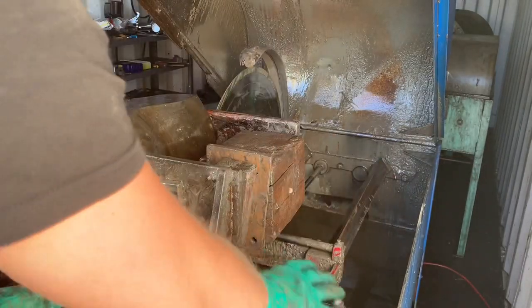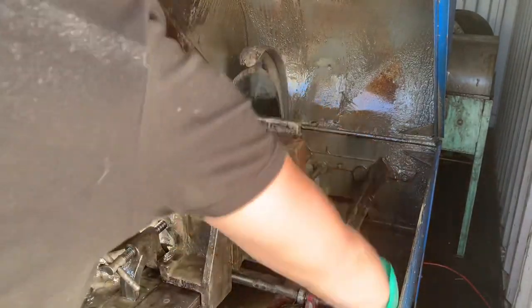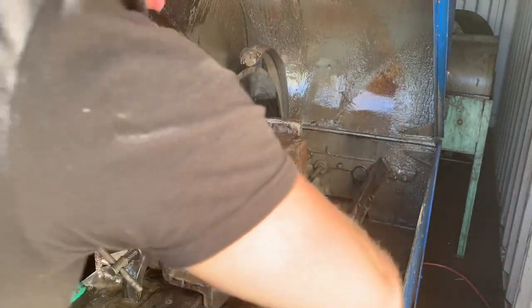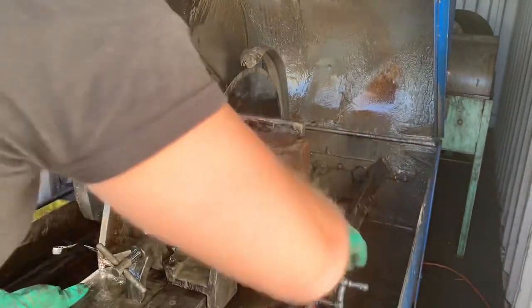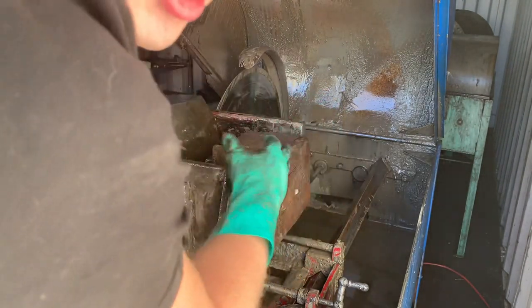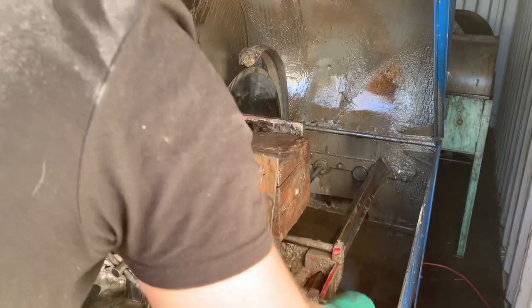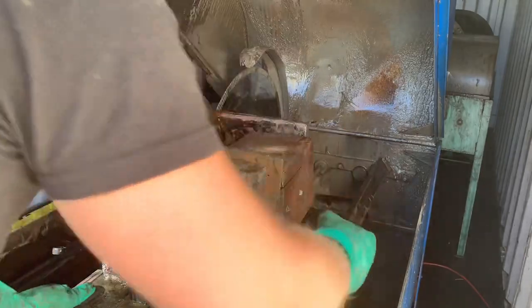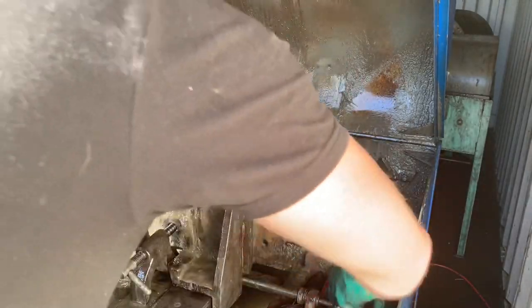Eventually, the finer mechanisms in the carriage need to be replaced because the bronze bushings do wear and get slop over time. Another thing too is that the feed screw needs to be pretty tight in that rear bushing, and that's usually one of the first things that wears out and changes. Now, unfortunately, that usually means you have to take the entire carriage and rails off.